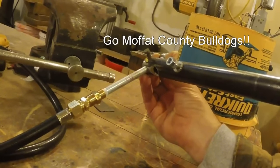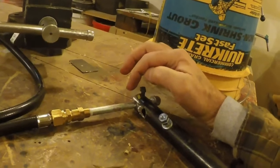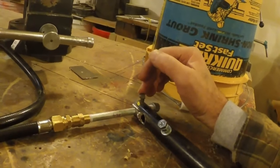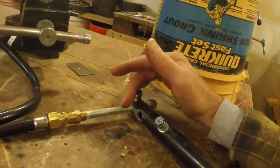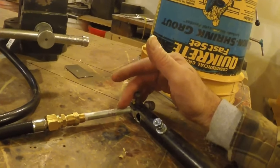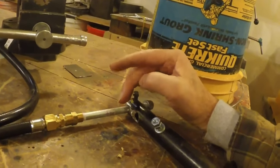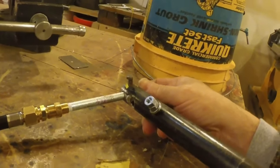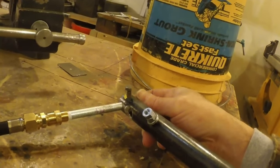And I started with a tube, this little galvanized tube, with a number 57 hole, which I believe is about 0.043 thousandths. And it ran really, really badly. It was lethargic. It was just way too rich. And I have a feeling it probably has to do with the altitude. So I dropped this down to a number 64, which is about 0.035, and this works a lot better.